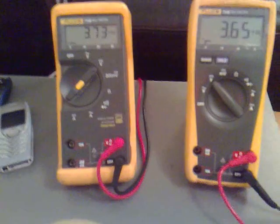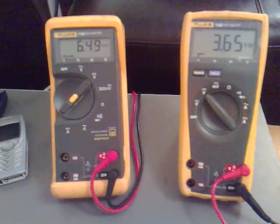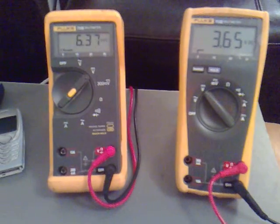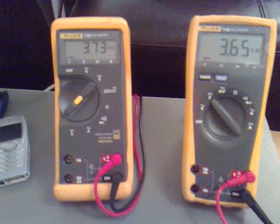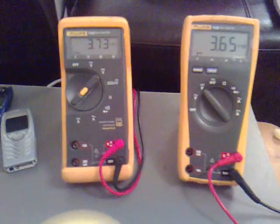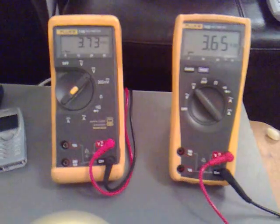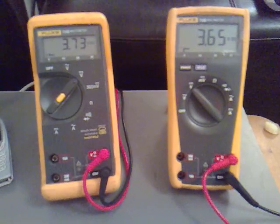That's the flyback voltage. I'm just going to do that again and see what the voltage is on both of them. That stays the same on the power coil — 6.35. So we're energising this battery. Now this was a completely dead battery; it wouldn't power the phone properly. I'm quite glad it's gone up to 3.73, which is actually 0.13 over what it's rated for. This battery, which is the one we're running it off, seems to charge up to 4.15, but I'm going to check in again a bit later.